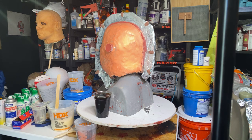Now, if you're using WED clay, which is a water-based clay, then yes, you would have to remove that clay, because it would harden to a rock over time, no matter how hard you try to maintain it by putting water on it and stuff. That's why I don't like using WED clay. I only use it for things like barrier walls, when I'm making a dividing wall. It's the only time I use it. It is cheaper to sculpt with, and if you're a real fast sculptor, then WED clay is probably the best way to go.